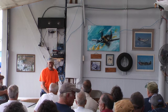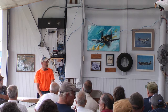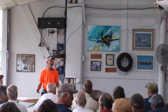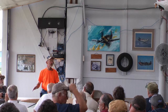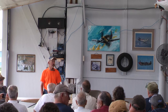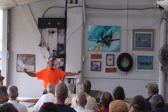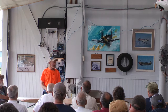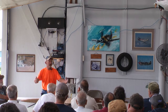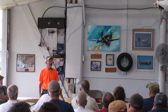He wants to know whether these planks were planed before they were glued. When I bought these particular pieces, they were provided planed, but yes, you really do need to have really nice planed surfaces to glue together. Make sure that all the thickness is uniform throughout the plank. So, obviously, if you start out with more precise pieces, it's going to be easier to end up with a quality product in the end.